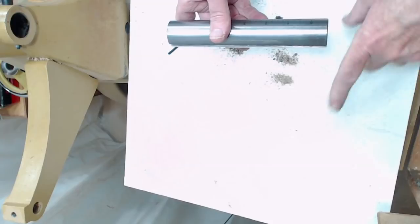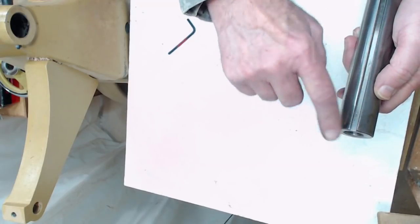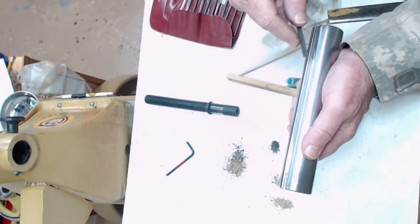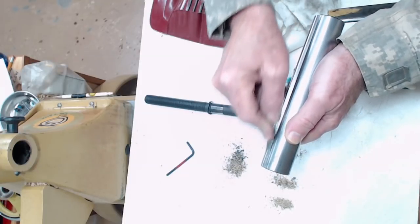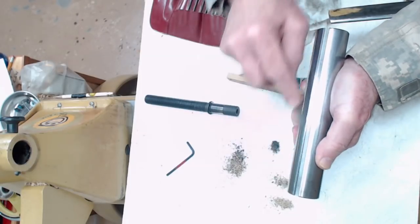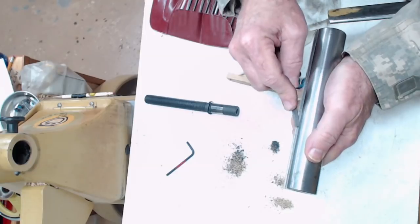The lathe turning this way is going to put torque on it on the bottom, not the top. So this is really where it's going to get a raised burr, and you need to look at maybe just cleaning that up a little bit. That's a pretty sharp edge there, so I'm going to take a small file. I do see some minor damage here, so first thing I'm going to do is reestablish this chamfer with a very fine file, just filing it down right there on the corner, relieving any sharp edges. Mine went fairly smoothly, so I don't think it's going to take much to bring it back into shape. This is fairly soft metal. Yours may only need a cleaning.